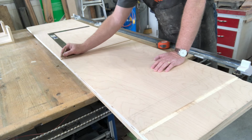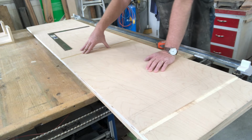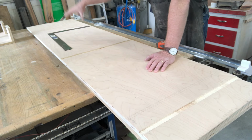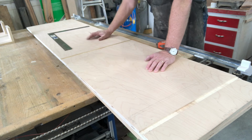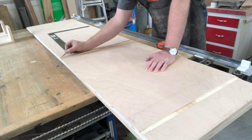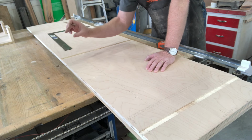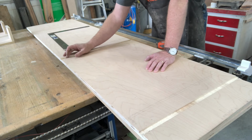But we're not going to make it come out flush here because we want this anchor shelf to have the appearance of one of the other shelves in the cabinet. So it's going to have a 3/4 inch face on it by 1.5 inches, so it's going to appear to be a thick shelf.